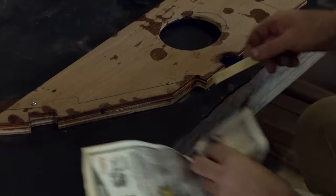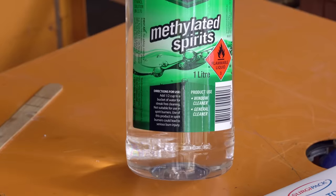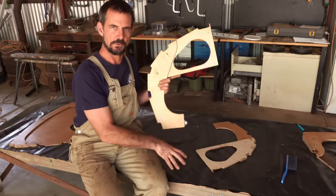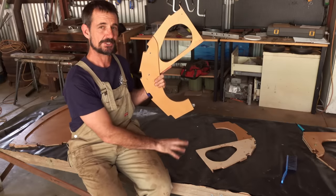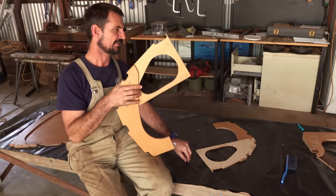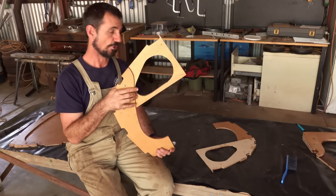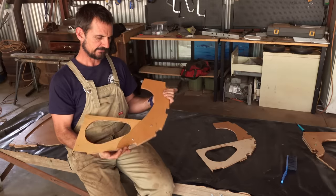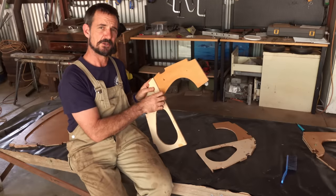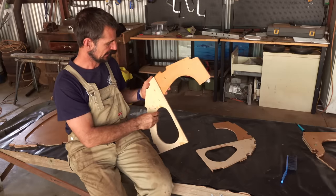Old newspaper comes in handy to save your rag supply, and epoxy resin can be cleaned off most things with methylated spirits — otherwise known as denatured alcohol — or you can use strong vinegar. You can see now why we had the black builders plastic put down: epoxy just doesn't stick to it. I didn't even wax it or anything. It might be HDPE — I'm not exactly sure. It's very good for preventing resin from sticking. These frames have done very well, and I can take the screws out now — they're all glued together. It was well worth using those paddle-pop chisels to clean things up; I don't have any sanding to do.